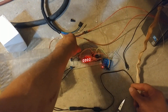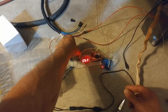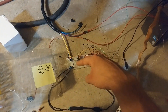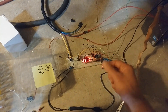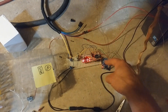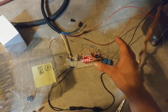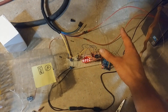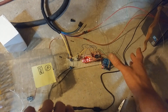The potentiometer here is for adjusting your set point - it's reading like 127, 129, etc. The plasma comes in right there and you read the voltage of that. Here there's the inputs for power supply, and over here there's a pair of relays for sending the up and down signals to the parallel port breakout board for LinuxCNC. These relays will not work in real operation because they are far too slow, but I do have some optic couplers in shipping right now. When they arrive, I can put them in and they should work much better - much faster switching and they still provide isolation between the Arduino and the computer.